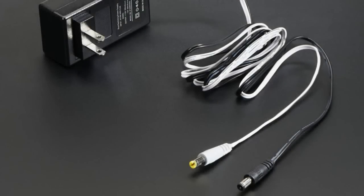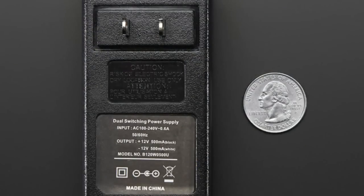It's rare to find one that has the ability to give you two power outputs. Especially if you took like 6.101 or 6.11, chances are you used a benchtop supply when you had to build one — it gives you plus and minus 12 volts for your op amp. That's what you do in electrical engineering. The problem is that it's actually hard in real life to get minus 12 volts and plus 12 volts. You can get minus by flipping it, but you can't get a true split supply. This power supply is custom built and designed to give you plus and minus 12 volts on two plugs referenced to earth ground, so you actually get a true split supply.